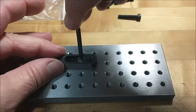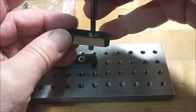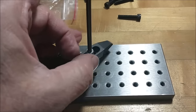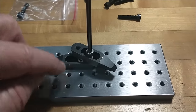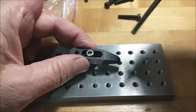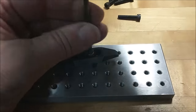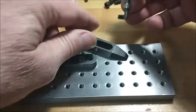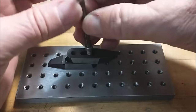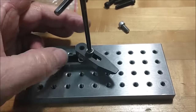Here's another thought — stack them. You now have an adjustable stop created by the use of two clamps: clamp one securely to the plate, clamp the other one to that clamp. Just make sure that when you tighten down the screw, it doesn't go all the way through and hit the plate, so use a shorter screw. Also, reverse the clamp should you need to. That makes for a good stop.